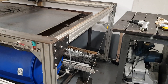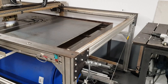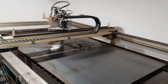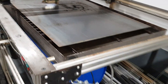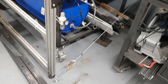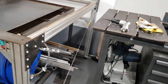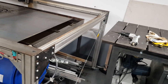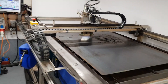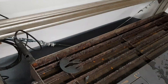I don't know if I mentioned this in other videos, but because I've made the machine out of aluminum profile, if you're running high torque motors you can get a little vibration. To combat that, I've put bolts into the ground and crank it down with cables, and that really takes a lot of the vibration out — it makes the machine really stable and has helped out a lot. I do it in the front as well as the back, as you can see the cables run down there.